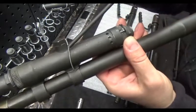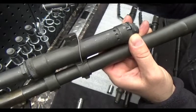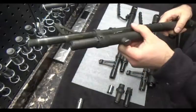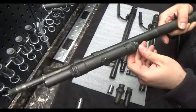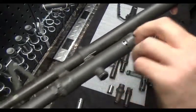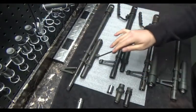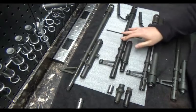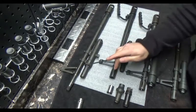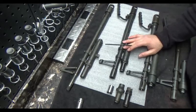You can see on this, it has safety wire hooked onto it. There should be some on the front too — this one just doesn't have it. You can see this is actually loose. The reason they had that safety wire on there is because when this gun is firing, this stuff works itself loose. You'd have gas extensions coming off, gas nuts coming off — and once they come out, your gun stops functioning.